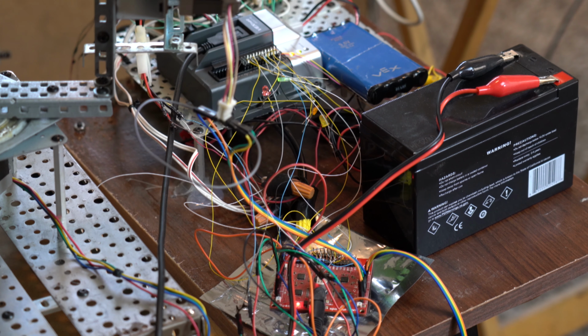The motion script generator runs on the VEX Cortex. It's just one of the functions of the stepper motor arm stepper application written in Robot C. And those LEDs that you see are the record and play LEDs that indicate when it's recording motion scripts, and the other one indicates when it's playing them back, so that you have a visual indication what the robot arm is doing.